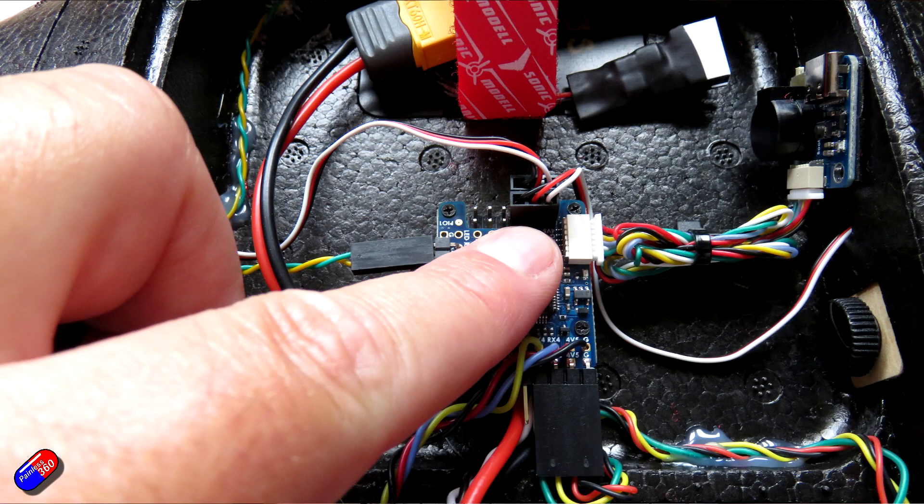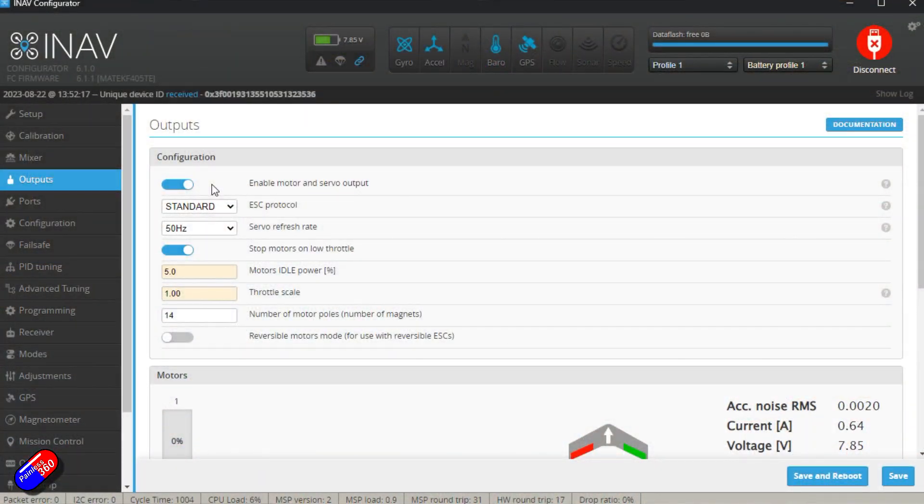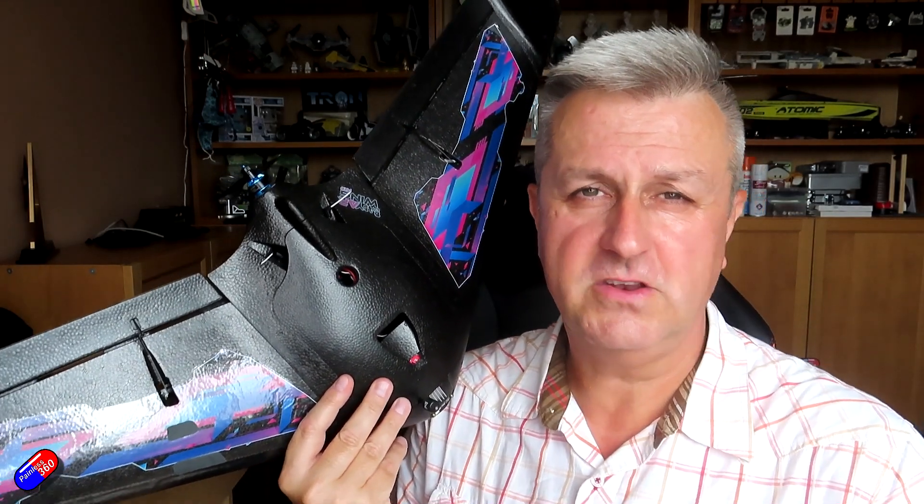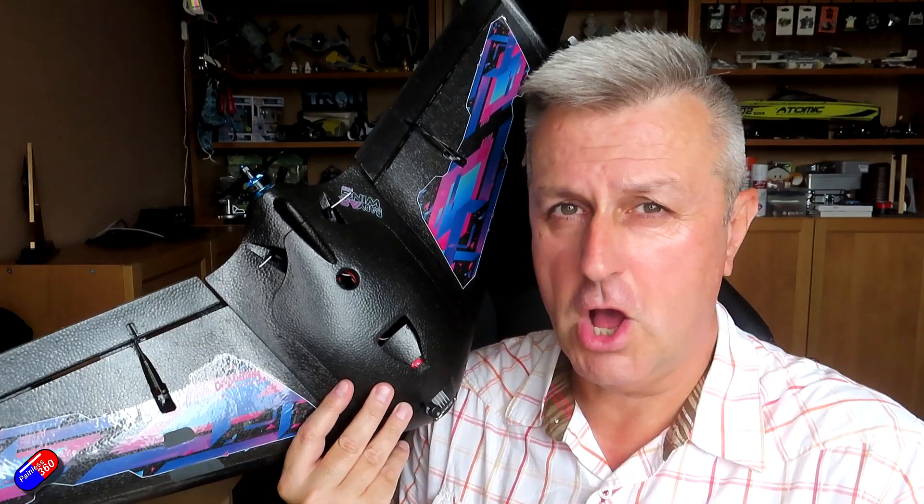Be careful that you're doing that, and also plugging them in the right way round — i.e. the ground pin is plugging into the ground wire and vice versa. Do also make sure that the outputs are enabled. The outputs by default in INAV are disabled; it's one of the last things you do in order to check everything's moving before you go to the field. This catches an awful lot of pilots out, particularly those coming from places where that kind of disabled output feature isn't common.